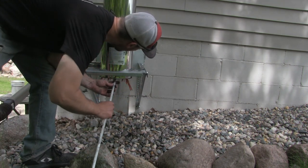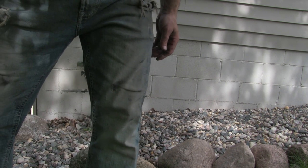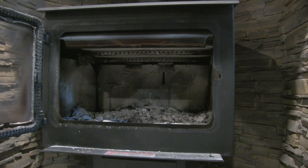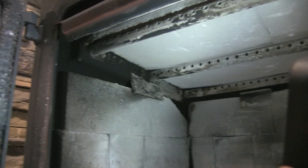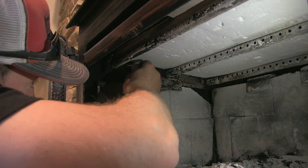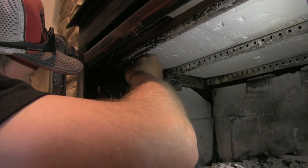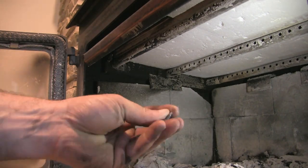What I like to do is go from the outside into the stove, keeping the stove closed to keep all the soot and dust away from filling up the house. Now we're in the house at the stove — what we have to do is remove the re-burn pipe that's closest to the doorway and remove the fiberglass insulation panels so that all the soot will fall into the firebox. I use a quarter inch ratchet to remove the one screw on the left side of the stove that holds that re-burn tube in, then wiggle that pipe back and forth until we're able to get it out.